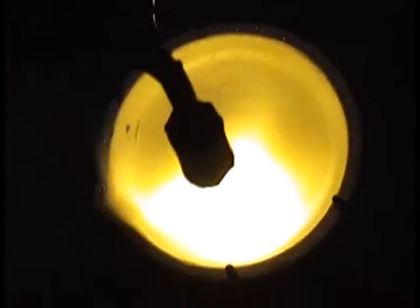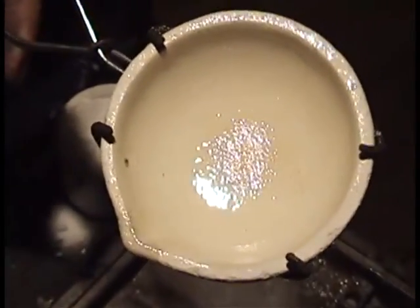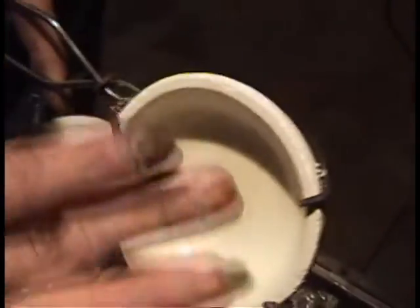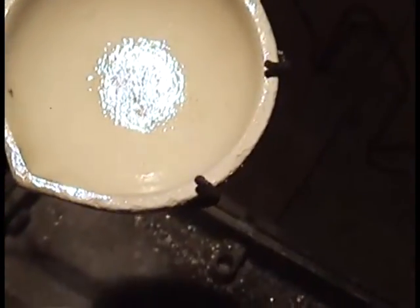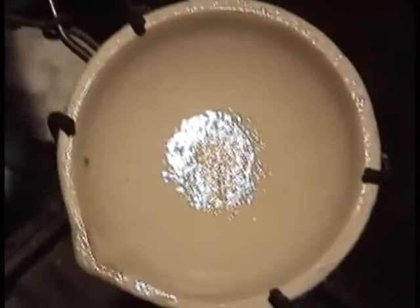Make sure we heat the bottom again good. Now when we add this silver to this dish there is no need for any flux whatsoever. This is pure silver in a clean glazed dish — you don't need any flux, and if you do, you have not done your job properly. Let's give that a second to cool and I will let you look at that dish. If you will notice it is shiny all the way around that dish just like it has a coat of fresh poly, including the lip area right here. And the bowl is still white — there are no metals in it.